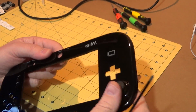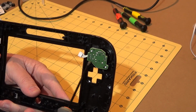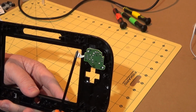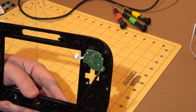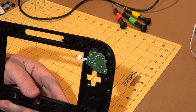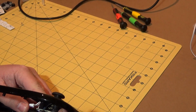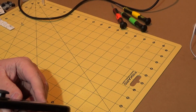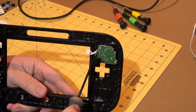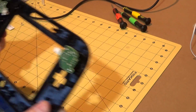So the click in button is a micro switch. That's probably going to be these 4 here. As we've already established, these 3 and these 3 are for the potentiometers themselves. So maybe these other ones around here are just mounting points. I don't know. But let me have a quick look. That looks like it might only be a 1 or 2 layer board, but it's not going to take me too long to trace out these connections anyway. That'll make things handy.